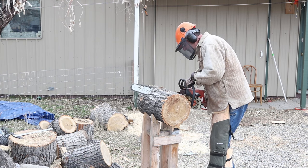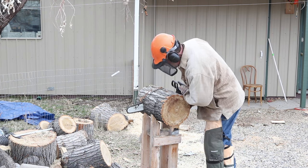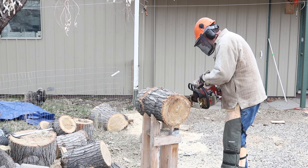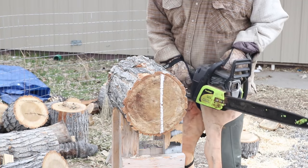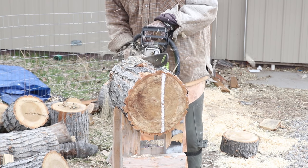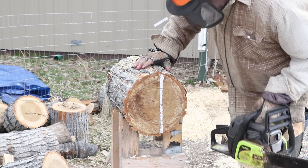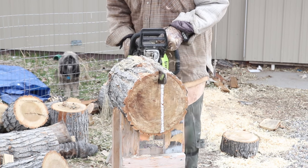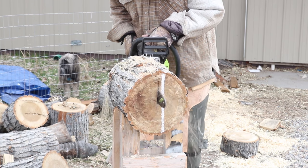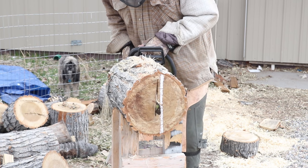I'll do a little play-by-play action here as I cut this wood up with my chainsaw. I'm just cutting this to length right now, and then the next step after that I'm going to cut it right down the center — split it. I've got some chalk there indicating the line that I'm aiming for, and you'll notice I don't aim very well, but that's okay. This is the typical way you make bowl blanks for woodturning.